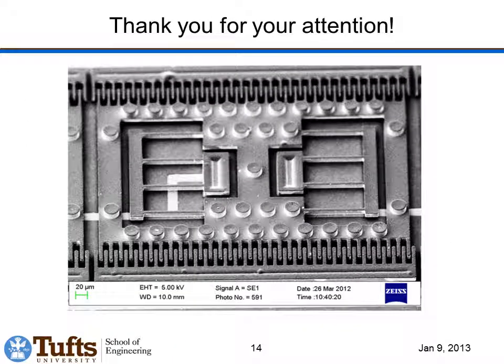Thank you for your attention. I've described a work in progress: a floating element with bump shear stress sensor being developed at Tufts in collaboration with Spirit Aerosystems. So far, we've demonstrated linearity to at least 13 Pascal, and we hope to create devices linear up to 100 Pascal — it's possible these already are. We just need to test them at higher flow rates to provide a direct skin friction measurement sensor useful to the aerospace and automotive communities for testing. Thank you.